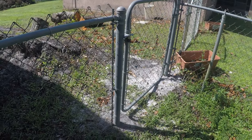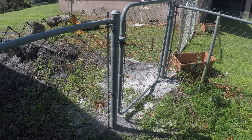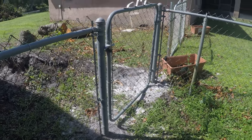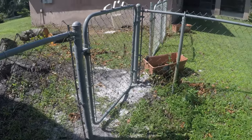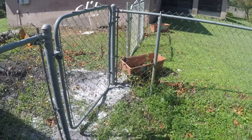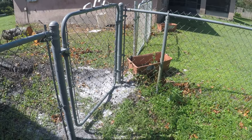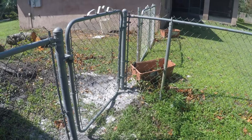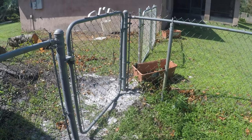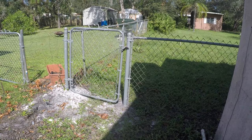And of course, on this side here, the fence is just normally like any other fence. I have the gate there. On that end of it, I had dug the post out of the other end, and it had a big cement ball on the end of it, so I put that down in to give it solid footing where the hinges hooked to it, so that the hinge of the gate's nice and solid. And so here's the gate across from the other end of the house.